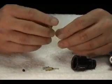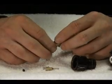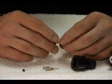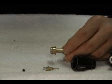Ensure you lube the O-rings before installing it back into the bonnet. This will improve the O-ring life and performance of the regulator. Ninja Paintball only recommends using 100% silicone lube, never oil.